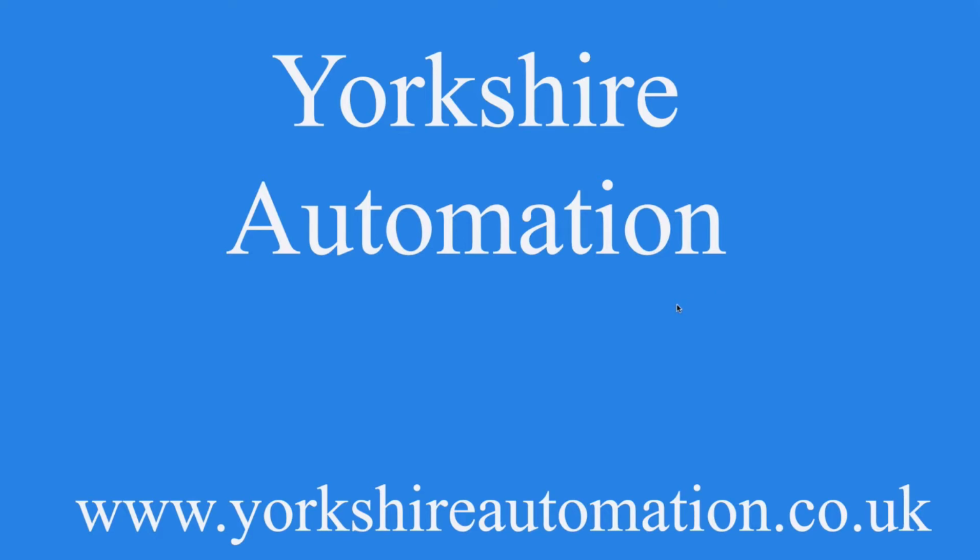Now that we have activated our NVR and given our NVR a fixed IP address, we can manage that NVR through a web browser. So the next part is we need to activate our cameras. In order to activate the cameras, I need to load up the SADP tool, which you can download from the Hikvision tools website. And I've already done that.